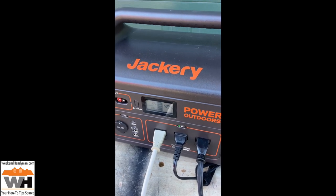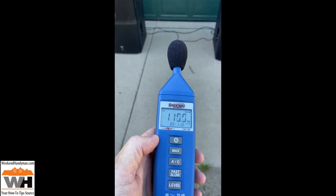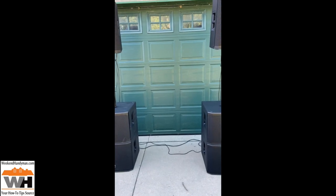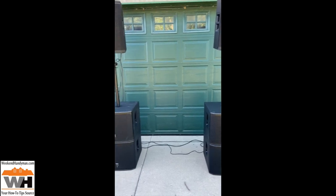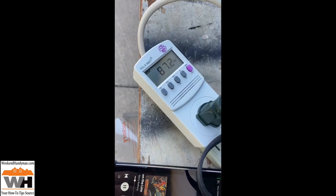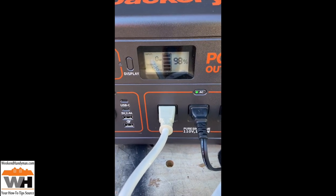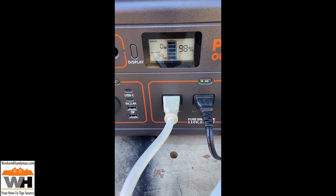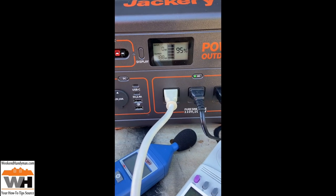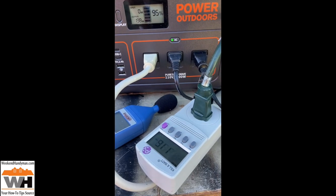I've got to do a voiceover because the music can't be on the video. We tried to set the audio between 105 to 110 decibels at a distance of about eight to ten feet away. We've got our four subs and two tops, and one stack is doing about 90 to 100 watts. That's the full load of everything — the mixer and both stacks of speakers. After 15 minutes, we're down to 95% of the battery and wattage is still up on both devices.